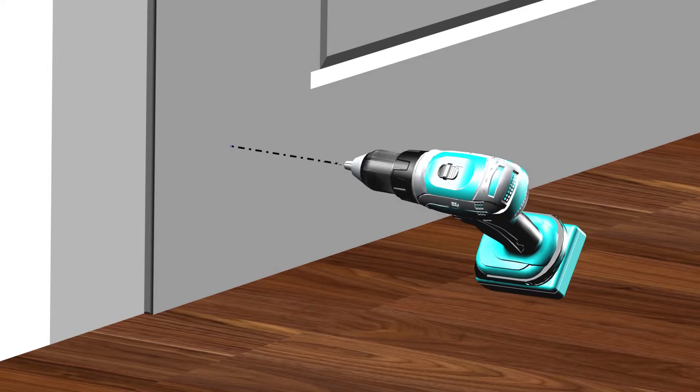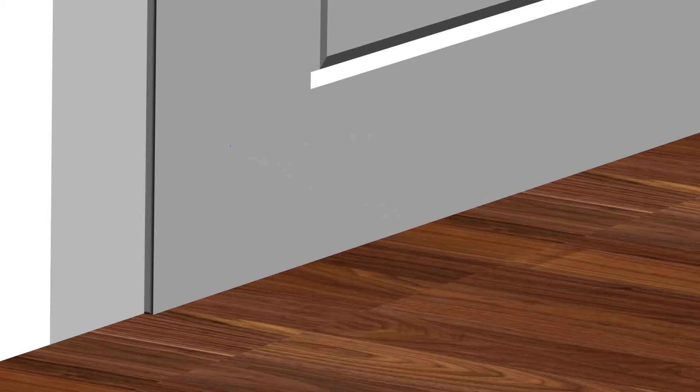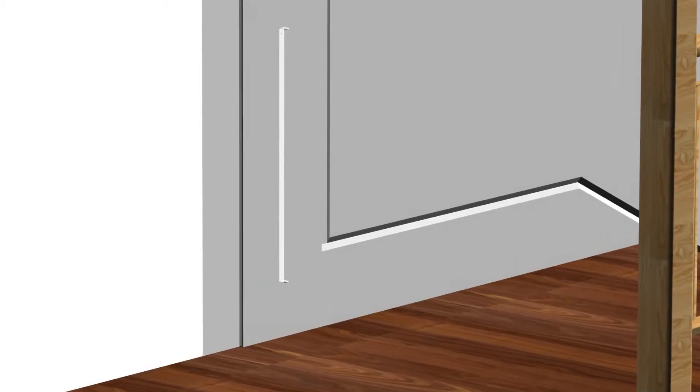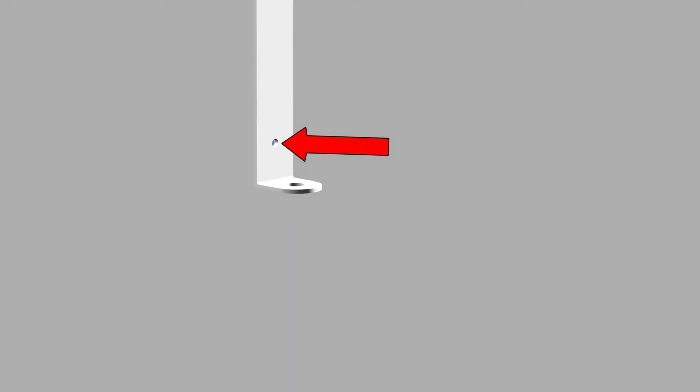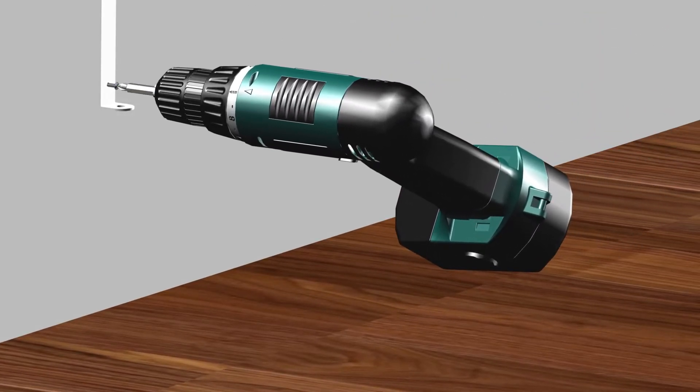Using a drill with a 1/8 inch diameter drill bit, drill a small pilot hole. Proceed by placing the hinge bracket, Part A, vertically up against the wall. Make sure the bottom hole on the bracket matches the drilled hole location. The bracket must be flat and perpendicular to the ground. Insert Phillips screw Part C in the bottom drilled hole if you are installing the gate in wood. If installing in drywall, Part J long screws may be used to attach the gate through drywall and into the stud. Based on your installation, special anchors for the wall might be needed. Tighten the screw using the screwdriver; be careful not to over-tighten.